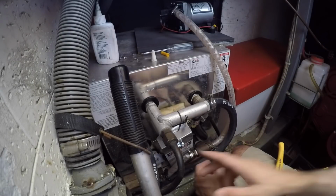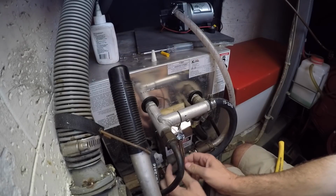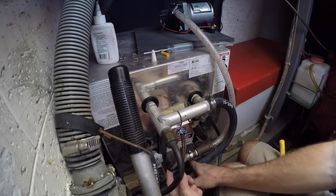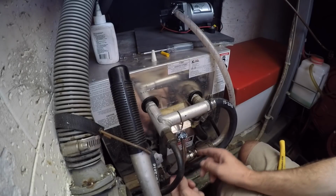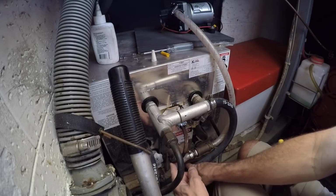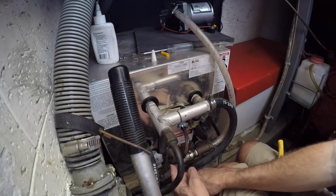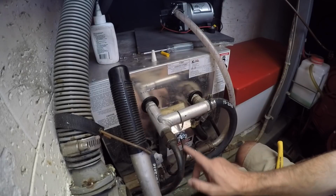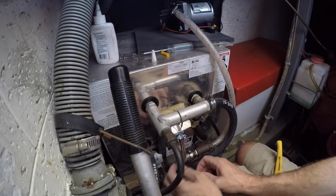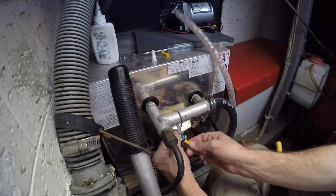What's interesting, and again, this is like factory harness wiring from the yard in Taiwan. The neutral, I'm sorry, the green ground is a separate lead, and it terminates into the base tab of the water heater, near the strip where it's attached to a stringer. I'm not sure why that's not going up and through the box here, but it's on the exterior of the water heater. I do have a ground. And I'm gonna crimp the neutral first and do the hot last.